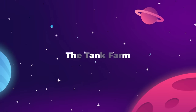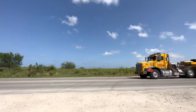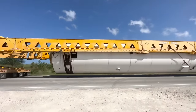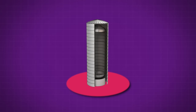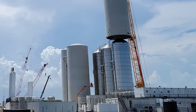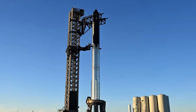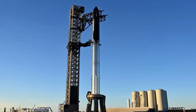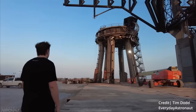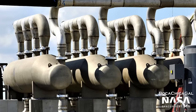The tank farm is a collection of large tanks that sits just a few meters away from the launch tower. The original idea was to build Starship's external tanks the same way SpaceX built the internal tanks — by vertically stacking 9-meter diameter rings of stainless steel for maximum efficiency. Because the tank farm needs to hold cryogenic liquid for long durations, each stainless steel stack was covered by an insulating sheath. This ground system allows SpaceX to rapidly tank and detank the Starship and Super Heavy for everything from cryo-proofing and static fire testing to full orbital launch.